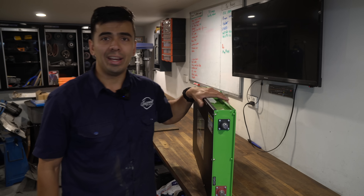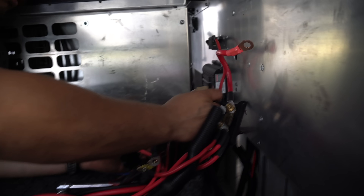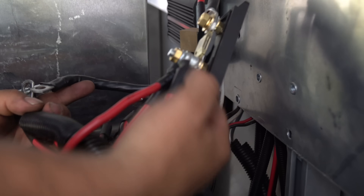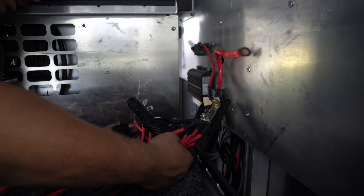So we're going to go ahead and install this now. Ev, what's going on? Just replacing these lithium batteries. We've just disconnected all the negatives from the shunt and we're about to disconnect all the positives from the fuse. We've also disconnected it off the inverter. A bit messy at the moment but we'll get there. We're filming this so we can look back and remember which wires go where - so thank you guys for sitting through it patiently.